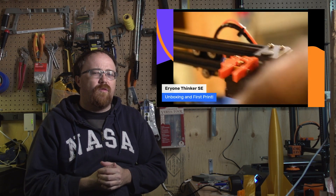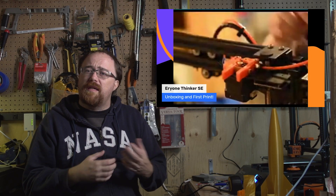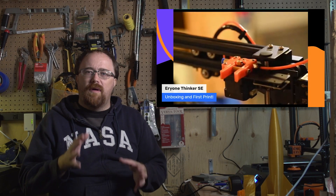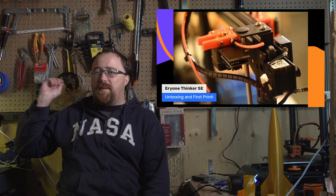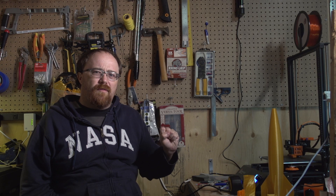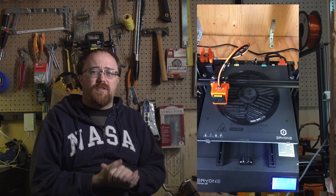Calibration will take you about a day or two depending on how much time you spend with it. If this is your first 3D printer, expect the first month to be a little iffy — a lot of user error, mistakes, and the occasional whoops on the bed height, which actually stays together pretty good. You do need to check it — I'd say check your bed height every week or so. If you're doing a large print, definitely check it.